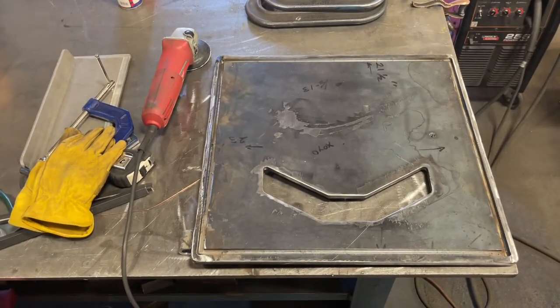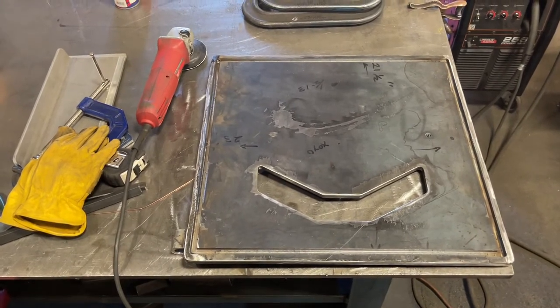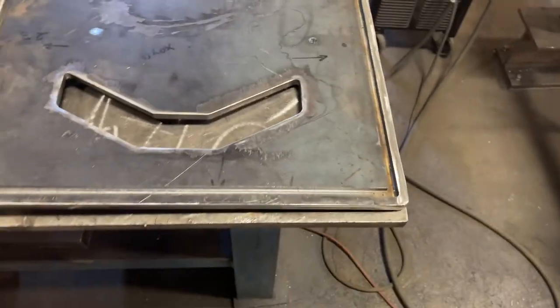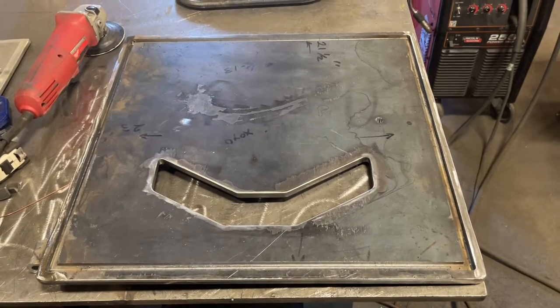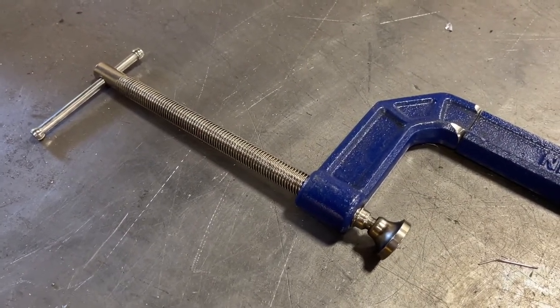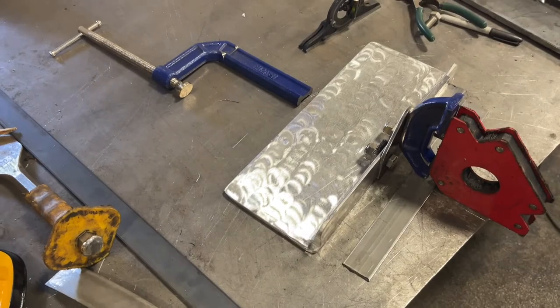We are now on weekend five or six — I lost track. Anyway, today we're starting out with finishing up the firebox door. I had my guys mill a slot around the perimeter so it'll seal up with some wood stove insulation rope, which will get glued in there. That way we'll have a good seal on that firebox. And for my next trick, I will be turning this perfectly good brand-new six-inch C-clamp into a firebox door regulator.